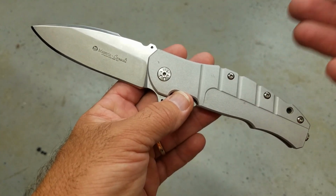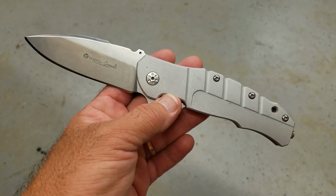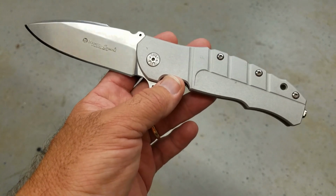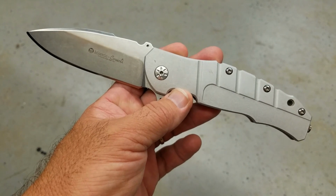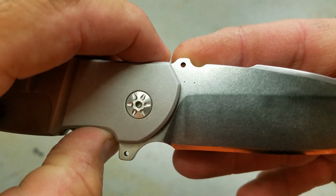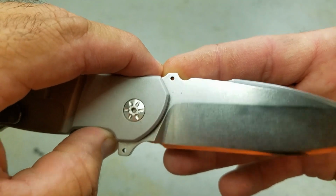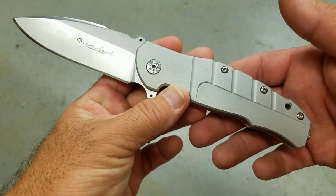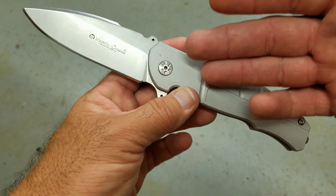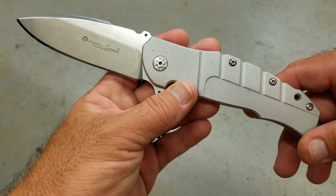Sharpened it, ran the test again. Got 137 feet fine edge and 181 feet working edge. At this point, that's when this went to Kurt. And he did test it twice. And it came up at 58.6 and 58.8 HRC. And this did about what the large majority of other 59 or so HRC M390 has done.